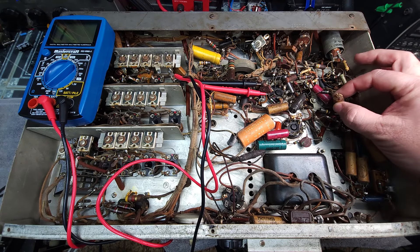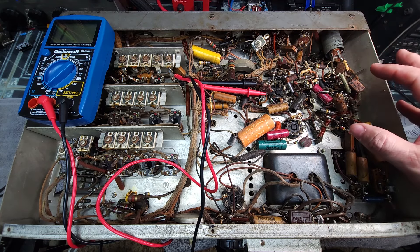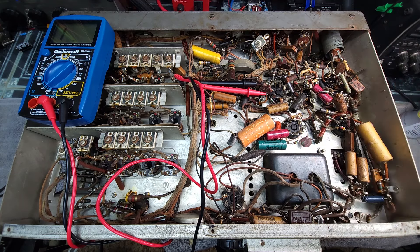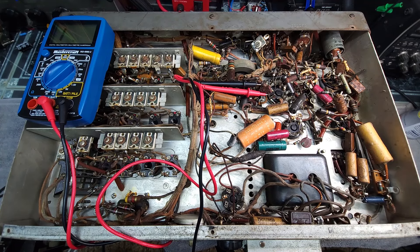I found other things. The fact that this capacitor and other things in this circuit have been cut was done to be able to test that IF transformer without anything leaning on it. A couple of the resistors are cut down in there as well. So somebody else had already figured this out and then slung the radio off for sale. Sadly, this is a showstopper — I will not continue with this radio.